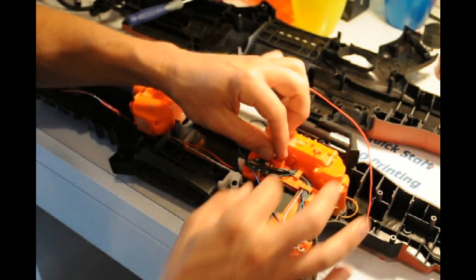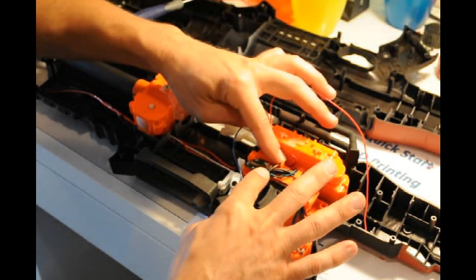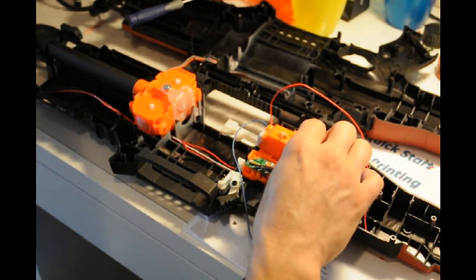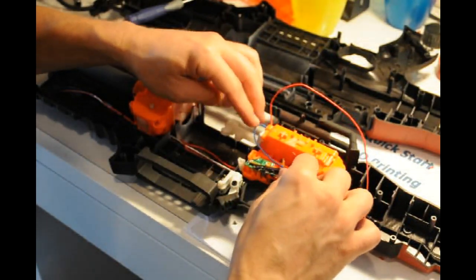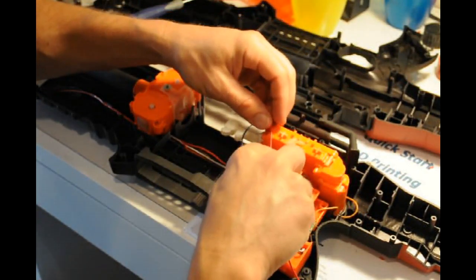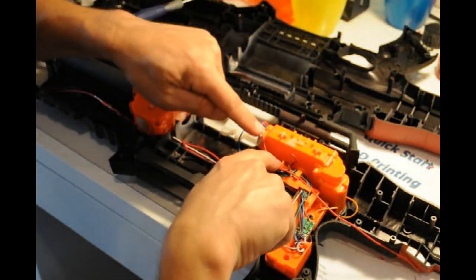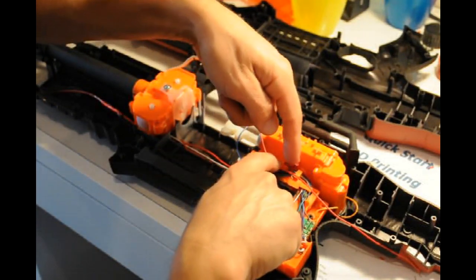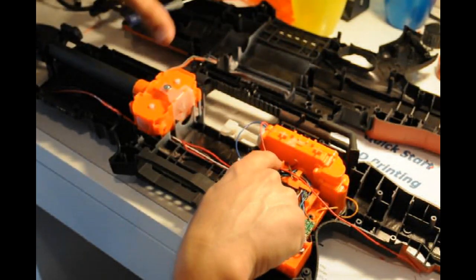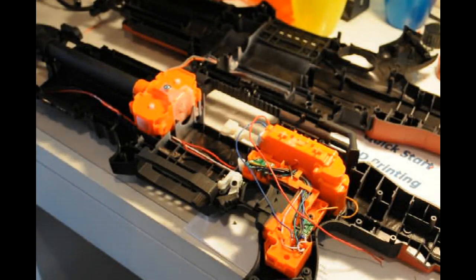So what I'm going to do is solder the negative lead right there to the negative contact, like it says there. The positive lead to the LEDs is going to be this little blue wire that's part of the switch. I'm going to solder those two together, and then this red wire here I'm going to bring down to the pad right here, which is the direct battery feed. So then we've got battery going through here, passing on to here, going through to the LEDs, lighting them up. When the button inside here is pushed down, it breaks the circuit and turns them off, hence the flash. So with that, I'm going to do some clipping and pre-tinning with the soldering iron and put those together.